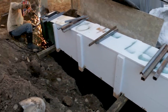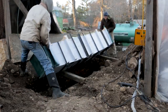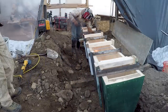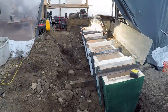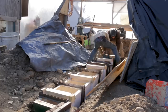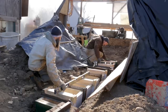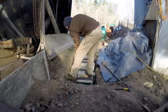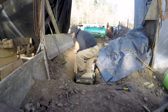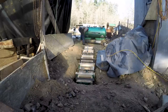Before putting the mold in the ground, we wanted to add even more support, but also include two strong lifting points we could use to pull the whole thing out later. We decided to weld over the hole we dug, as we were worried about welding in the boathouse with all the wood shavings around. Finally, with the hole dug and the mold fully prepared, we gathered some sand to line the bottom. This would let us level everything and was easier to tamp around than frozen dirt.